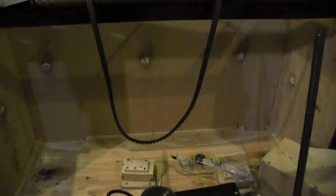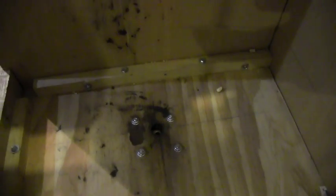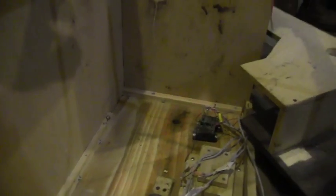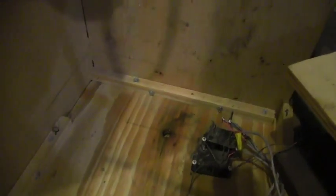Let's first discuss the failure. The failure was indeed, as I had suspected — the rod had poked a hole right through the bottom of the cabinet. It was a wood failure, more structural than mechanical. You might notice the four bolts coming through around the hole. There's no more bushing in the hole — I took that out and I'll show you that. If you look at the other side where there's been no failure, you'll see the difference — it's just clean, without the bolts, just the hole.